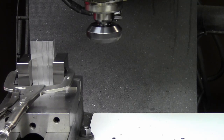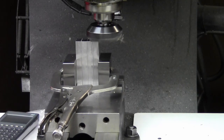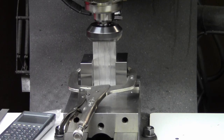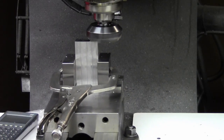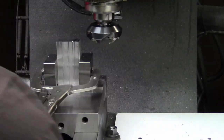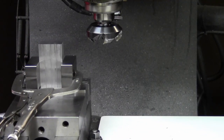I need a little bit for my back swipe at the inside, if the parts are smaller than the inside of the cutter. The inside lip of the insert is way sharper than the outside. It's doing all the work. It actually gives a nicer finish. The back swipe, obviously, only works when the length of the cut is smaller than the ID of your cutter. So, just as a double check, we'll do the measurement again before we loosen it up.